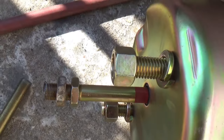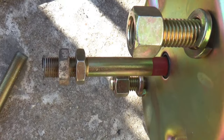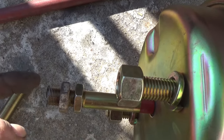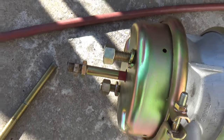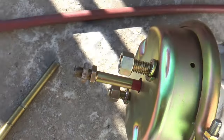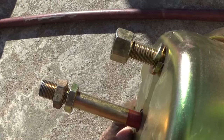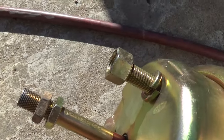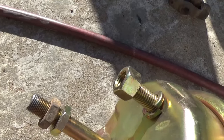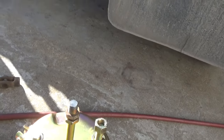That took less than a minute. I can take this over to the bench grinder and just hold this whole unit — just touch it up, spin it around, wipe the edges off a little bit and smooth it down. I could also do it with a handheld 4-inch grinder. It took less than a minute to cut that off — probably 30 to 40 seconds — and then probably another minute on the bench grinder. I went over to the brush wheel and buffed it up a little bit, so maybe two minutes total on the grinders and buffer.